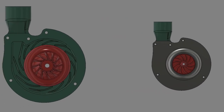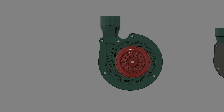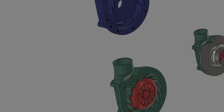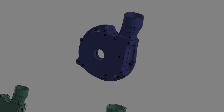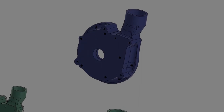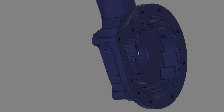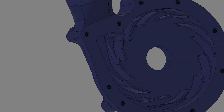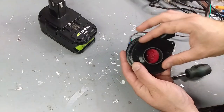For further development on this I have scaled it up and modified the housing slightly, as well as modified the housing to fit my gearbox that's currently on the supercharger on the engine. I'm also toying with putting a gearbox on the small version and shaft-driving it like the large version, for a very small engine. Judging by the flow rates, we're looking at under three horsepower, and that's about it for this project currently.